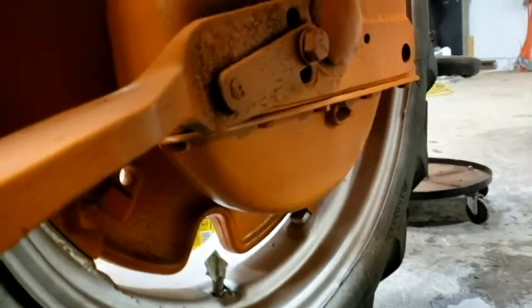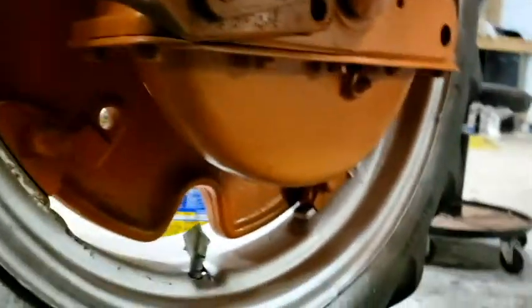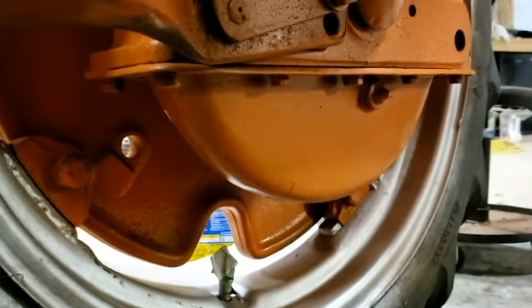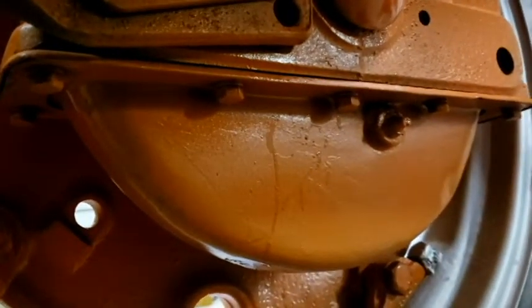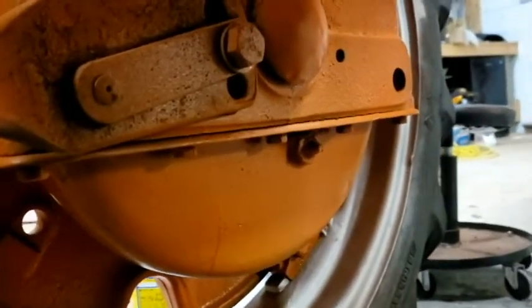There is one more spot that gets gear oil. I'm not going to do the procedure right now since I don't have time, but these final drives have an oil bath in them. It looks like about eight bolts to remove the cover - you drop the whole cover down, dump the oil out, clean out whatever sludge, bolt it back up, and right here is your filler hole. You fill it the same way you fill a differential. Don't forget to do those - thanks for watching.